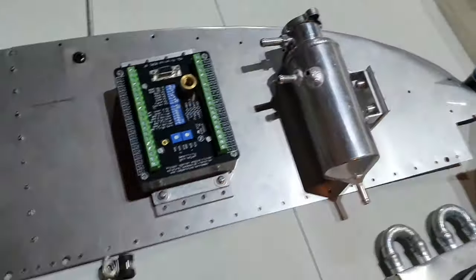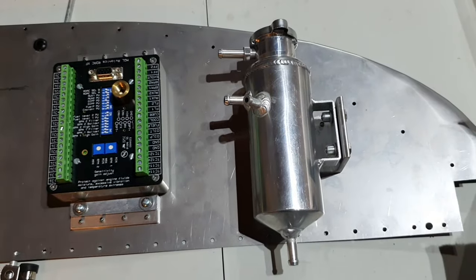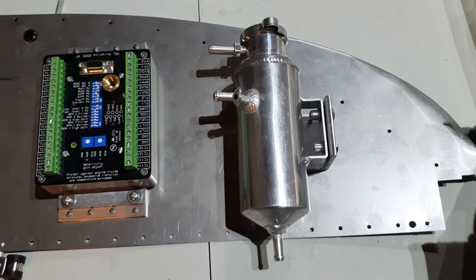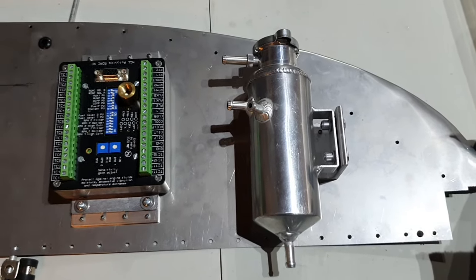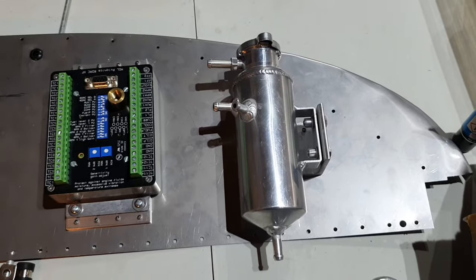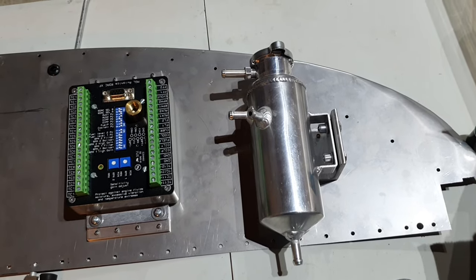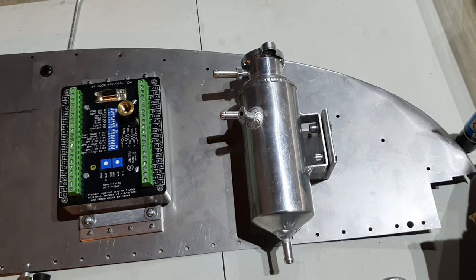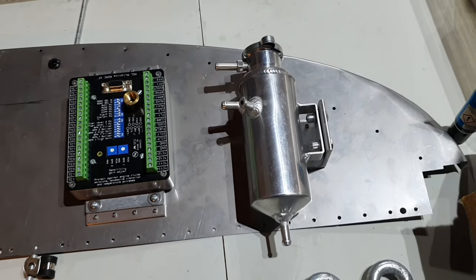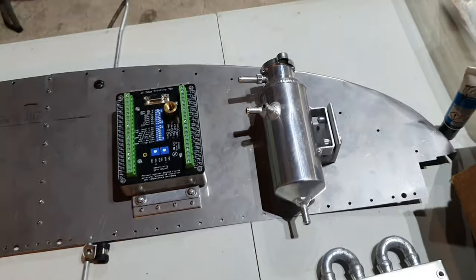So I fitted the new position of the RDAC unit, and I've also located my header tank for the water cooling system for the turbo here. I've decided to go with the Chinese cheap one, which I've ordered some larger barbed connectors for. I'm going to talk to my local welding guy and basically have him cut these ones off, drill them out, and put some larger ones on. So the 10mm OD and 7.5mm internal diameter to match all the rest of the pipe work and the turbo